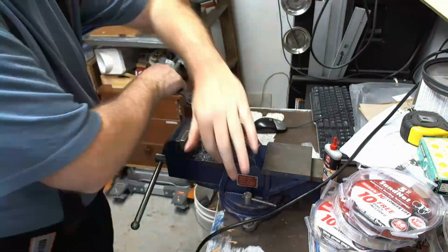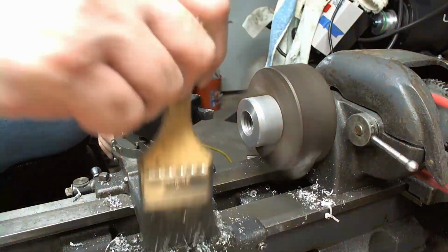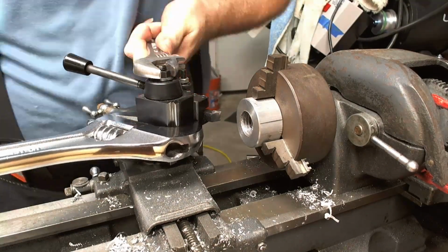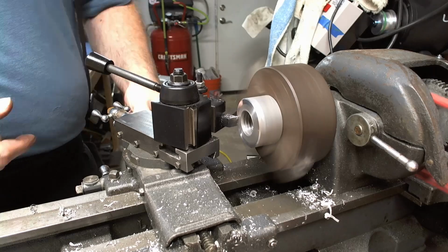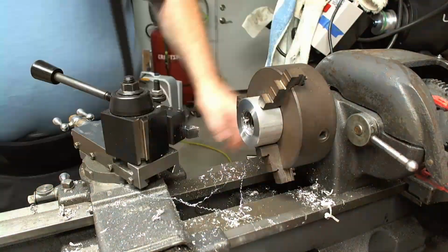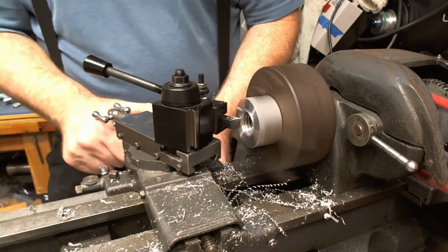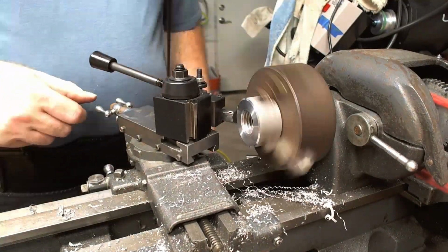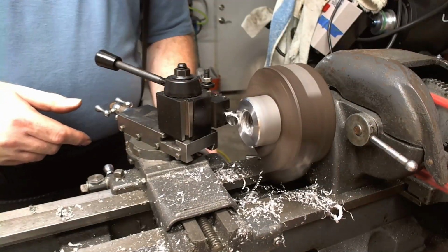And then got it back out, flipped it over, put it back in the lathe, cleaned up a little bit. Alright, face off for the sections where it made a mess of the surface. And you can see I had to use the big crescent wrench for that. And face it off to get it all cleaned up from where the threading put little extra bits on the surface again. And then just clean that up, switch it around, clean the other side up, try and clean up the edges. And yeah, there we go. And that's better chamfers. And that's it for that section.